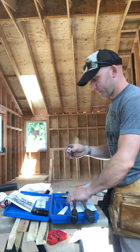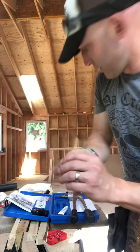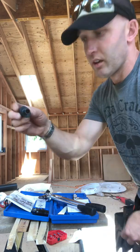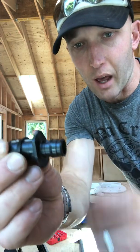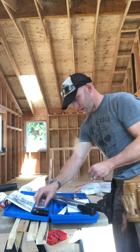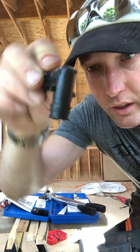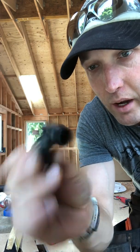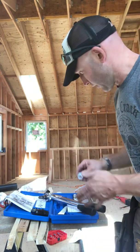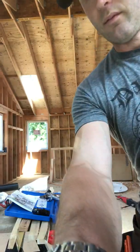For this you take a half-inch pipe — these come with little stops on them. There's a tiny little stop inside one end; use that, slip it over your pipe, expand it with your expander. Most fittings, like this reducer, will have a stop — push it all the way to the stop. T's, 90's, whatever — they all have a built-in stop also, as you can see right there. It's very easy to plumb with these. I went with the plastic fittings over the brass because the brass has questionable manufacturing locations — China and whatnot — it has a lot of impurities and the reviews online said they weren't lasting.